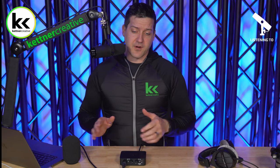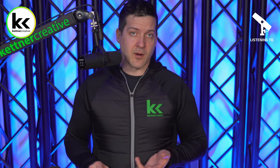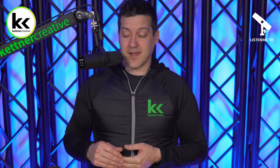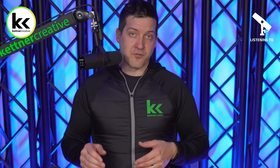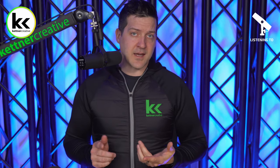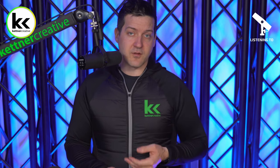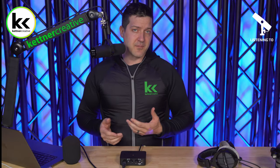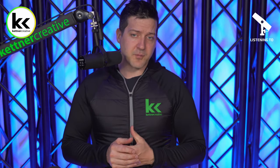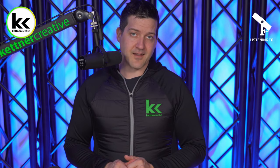I don't think the Cloudlifter is necessary with the Rode AI-1 — we weren't getting meaningful hiss at 75%. If you're up at 90–95%, then consider it. So, do I recommend the Rode AI-1 with the Shure SM7B? Yes. It provides enough clean gain to record in that minus 10 to minus 20 dB range with very little noise — no distracting hiss, hum, or pops. With good mic positioning and a reasonable speaking volume, you don't need any inline preamp. If you have questions, leave a comment below, and please like and subscribe.